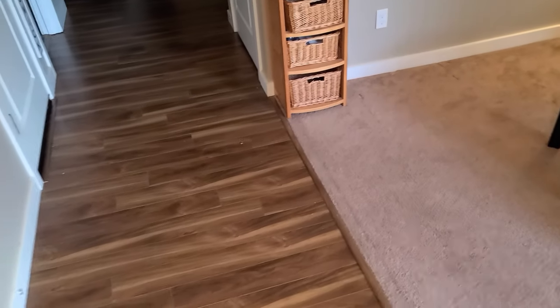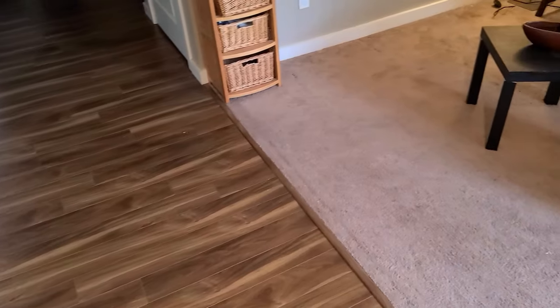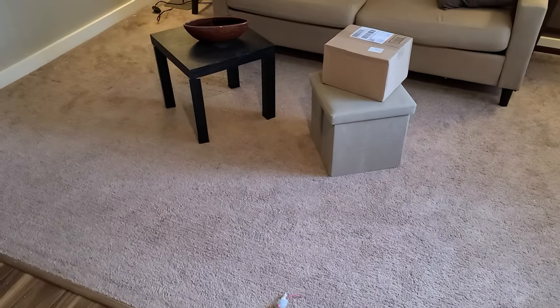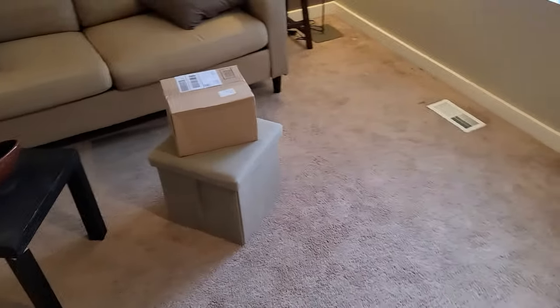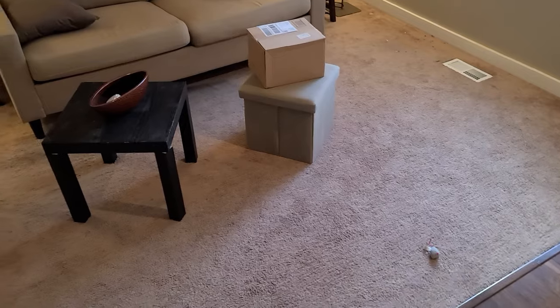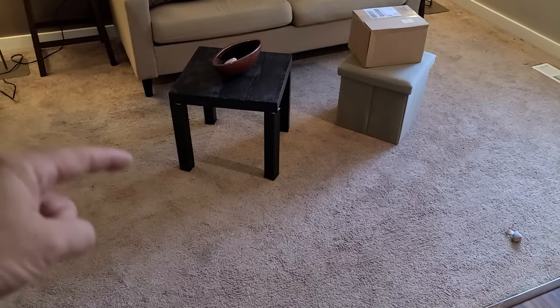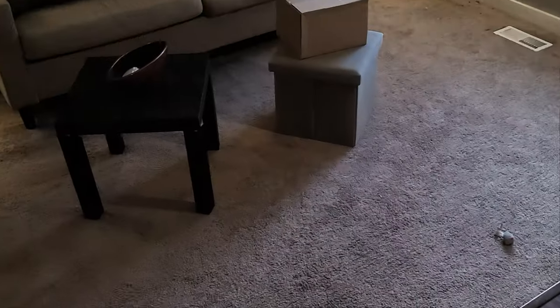Well, my neighbor took out his floor, which was the same as this, because we live in a tract home community, and we stacked it up in the garage. Today, I measured this, and it is 108 square feet. And what does 108 square feet tell me? Well, I need about 58 to 60 full-length slats that are about 4 feet long to fill this area.